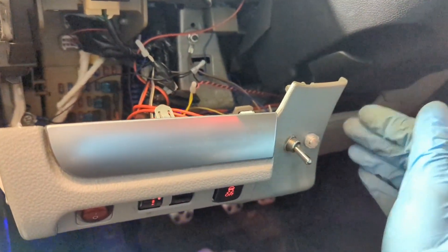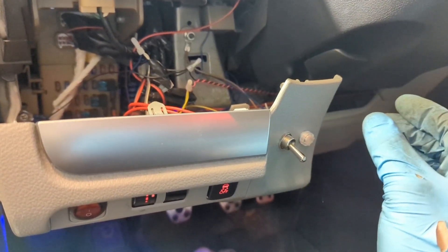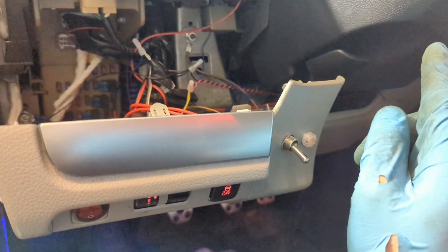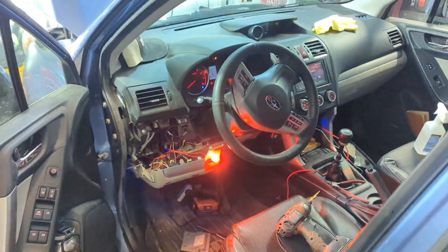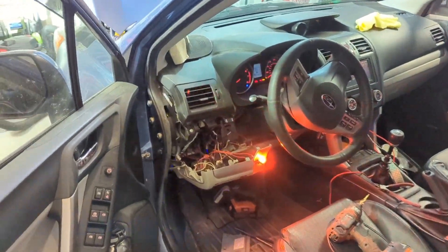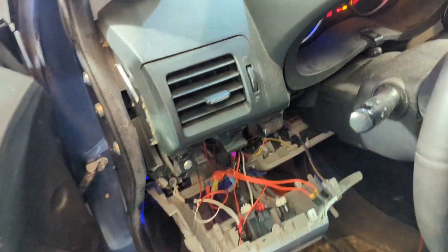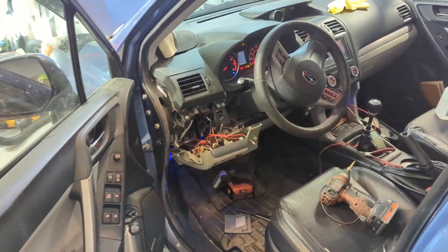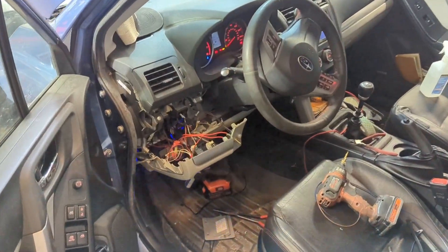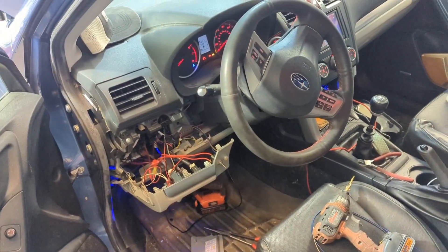The car is off, so there's zero oil pressure. That means the low oil pressure switch connected and sent power into its electronic valve, but also back towards this LED. That is an extremely bright light — I made it that bright because I want to know when the system has low oil pressure. This isn't a track car by any stretch of the imagination, but I still want to know when things are acting up.